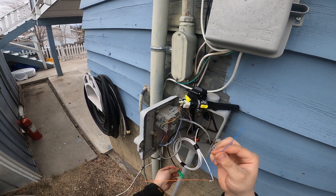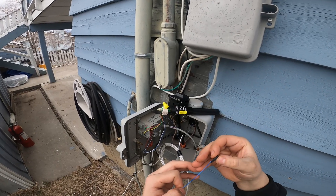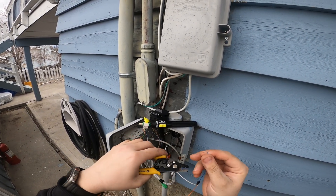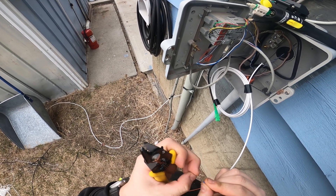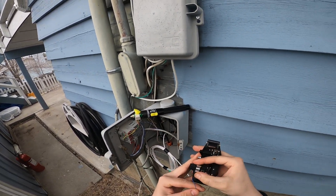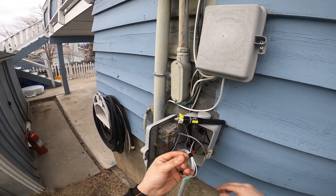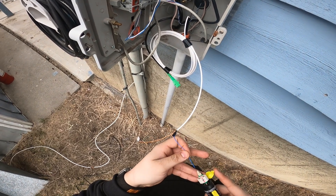Blue is plugged into port three, which was previously plugged in here, so that's what we're going to splice back. I'll slide this on now so I don't forget. Now going to the number two spot — peel that back. It still has one more layer of cladding on it, but that's fine because it's going to get cleaved off. This cuts it to the appropriate size. Put it there, and then it's cleaved right to the size it needs to be. I get the Ruby on and pop it in there.